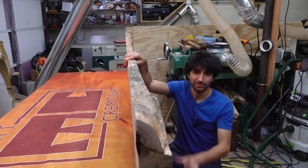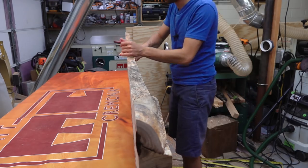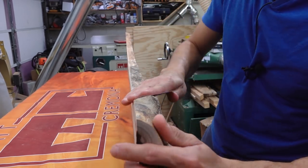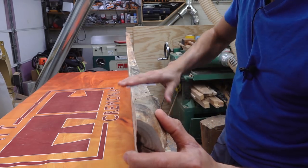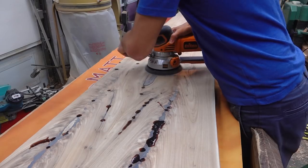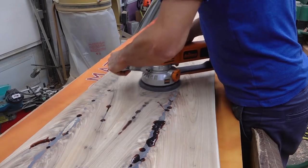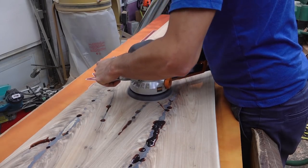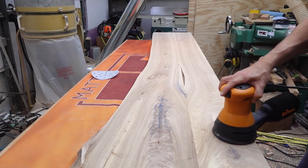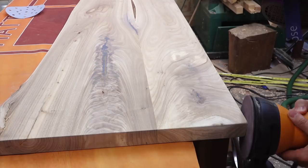The epoxy is all set up now and I'm ready to start working on the finish prep. I'm going to start addressing the live edge — I don't have a whole lot of work to do here since the bark fell pretty cleanly, so I'll just give it a light hand sanding to clean up any debris and start breaking the edges to soften the feel. Then I'll start surface prep with the sanders, starting aggressively to knock down the excess epoxy. I'll also use the sanders to lightly break the edges as I get up into the higher grits, and round off the corners a little bit to make them softer.